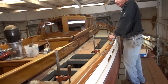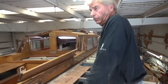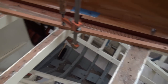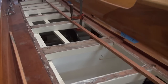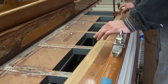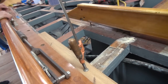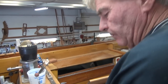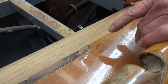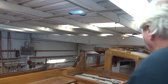We are experimenting with bending our teak. This boat, Chochosan, is six feet shorter and two feet wider, so it's got a lot of dead curve. This boat has a lot of curve but it's longer and narrower, so the teak bends in fairly readily. This piece isn't one we're going to use — the ends aren't very good, but we can use it for shorter pieces. This is mainly just sampling. We've got to make a lot of patterns and a little jig. When we put the deck down, this piece of hardware has to go right back on those holes, so we have that to do in several places.